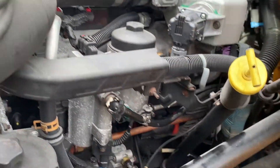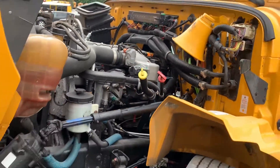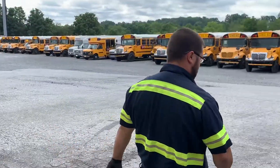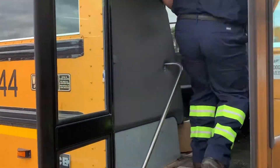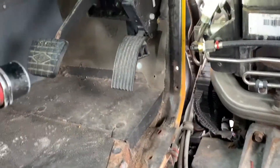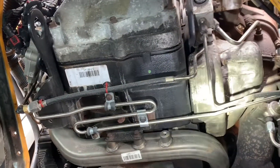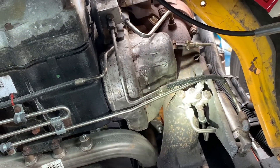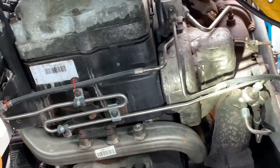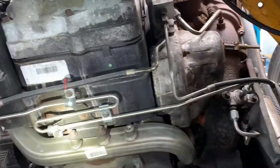Looks like a lot more once it's all installed, but it's still pretty simple. If we come around, I can show you the DSI and the injector and how it's located. There's your DSI metering unit, which bolts to the back of that intake manifold. And then there's the fuel line that goes all the way to your downstream injector right there, which is mounted in your exhaust brake elbow. Hopefully seeing it this way breaks it down so technicians can understand how this works.